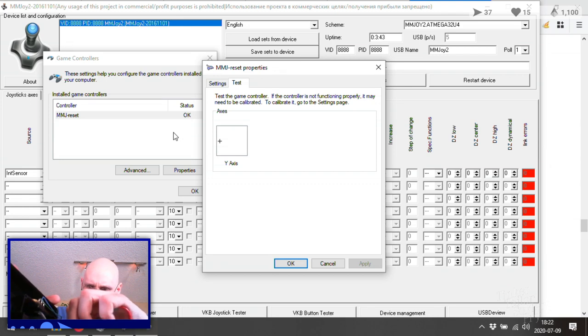So I am getting resistance and changes in voltage between the orange and the yellow. And it jumps, yep, it goes closer to 5, and then down, and then up. Okay. Interesting. DC voltage. So that was my question, are the pots still okay? And the pots appear to be okay. So that tells me that A3 definitely is that.